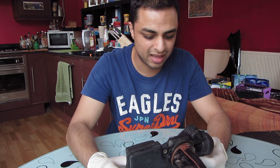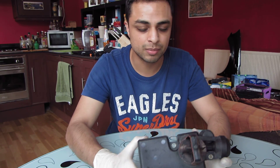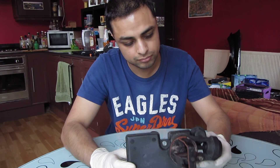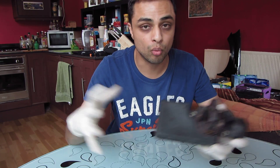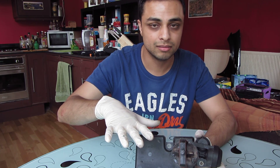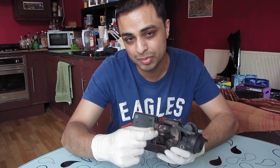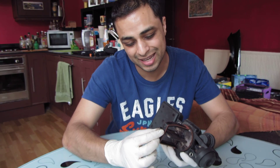My DISA is not the healthiest, but certainly not the unhealthiest. I'm going to fit it back in for now and do a little bit of reading up on some of the upgradeable parts you can get — the aluminium shaft, different end piece, different gear, and a replacement pump. However, I do have one big concern: this is a one-piece unit designed and built by BMW to be put together once and only once. It's not like a valve cover gasket where you replace a little rubber gasket and put it back together. BMW will not sell you any serviceable parts for this unit, so if you take it apart and put it back together — specifically this shaft, flap, and end piece — I would question the overall integrity of the unit.